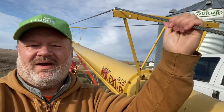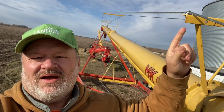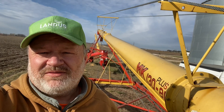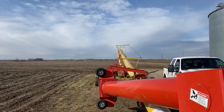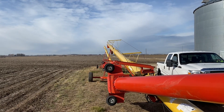The first one we're going to hook up to here is this 81-footer. Because of all the paint, I'm actually going to connect my wire from the radio up to these support cables, because they're nice and paint-free and I can get a good connection on them. They go kind of up and over the top, and it's all connected metal to metal. Just so we understand the orientation, I'm facing west right now, so they are pointing to the west and east is behind my back.